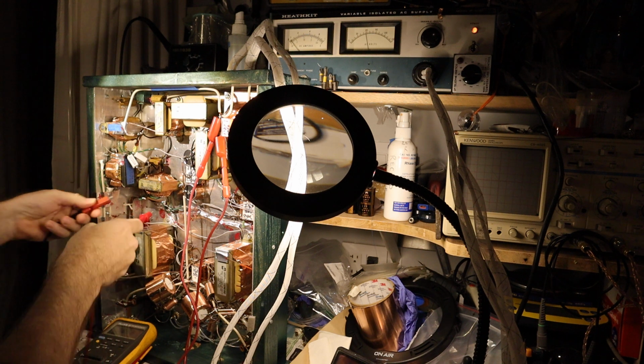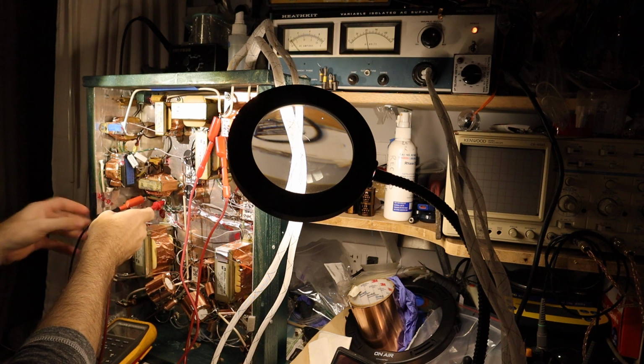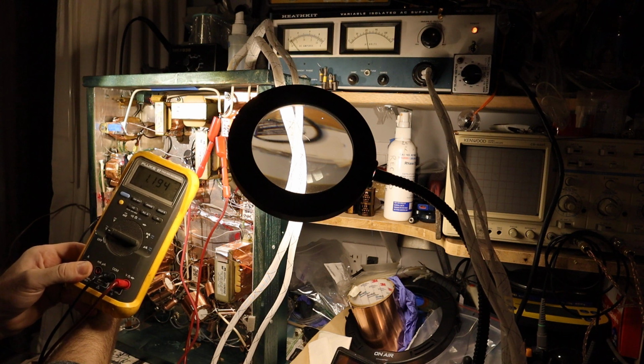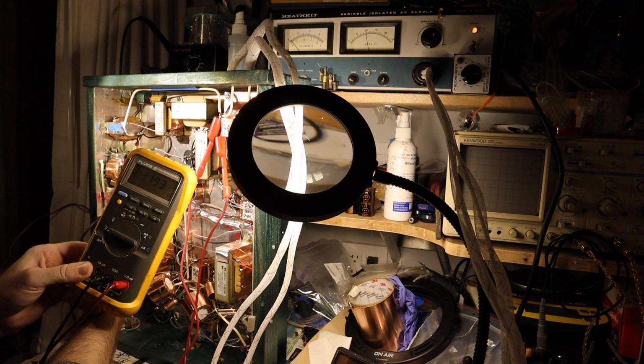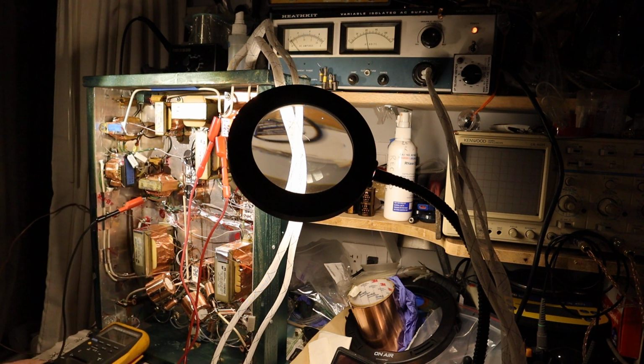So what I will be measuring here is expected to be 1/2. So I'm measuring, look, 1.195 volts. Can you see that? That's absolutely perfect. Basically 1.2 volts at 50% of the line voltage. So multiply that by 2, so that's 2.4 volts. Bingo! That's right, as they would say, right on the money. So right in the expected range, which is 2.5 volts plus minus 5%.